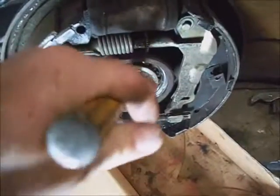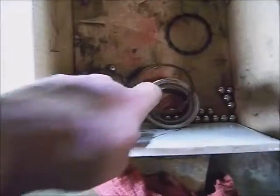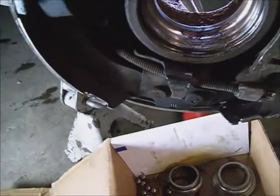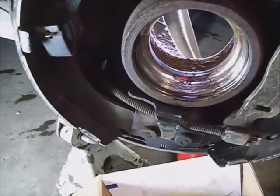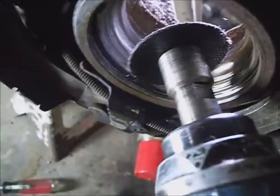I've got a good bite on it. Just stick a punch in there and hit the center of the race. Set a box to catch the ball bearings — they're going to come flying out of it. Do it from that side, then go on the back side and hit this race out. The inner and outer race — I just need to cut a groove through this to weaken the structure but not get into the housing. I keep cut-off wheels and stop using them when they get about half the diameter so I can fit them inside of bearings to cut them when I need to.